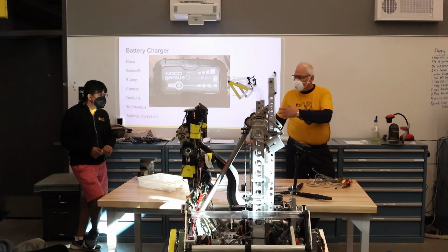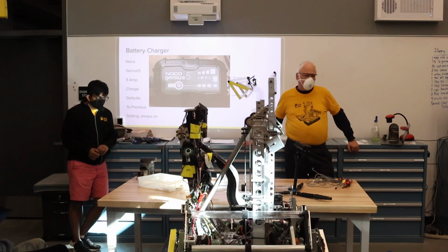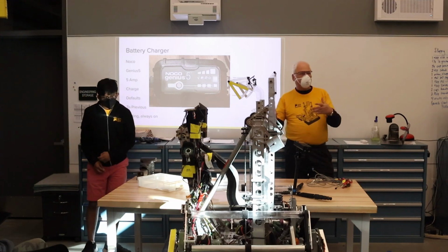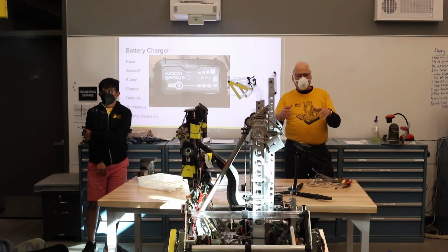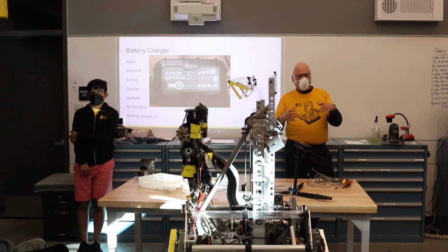One thing I'm not showing here is the team acquired a battery analyzer. With the analyzer I can draw up to 80 amps, and I use it to characterize the batteries. I create a program that simulates a match, and I use that same program on every battery. Then I can do a linear regression to generate equivalent series resistance for the battery, and use that to compare batteries.